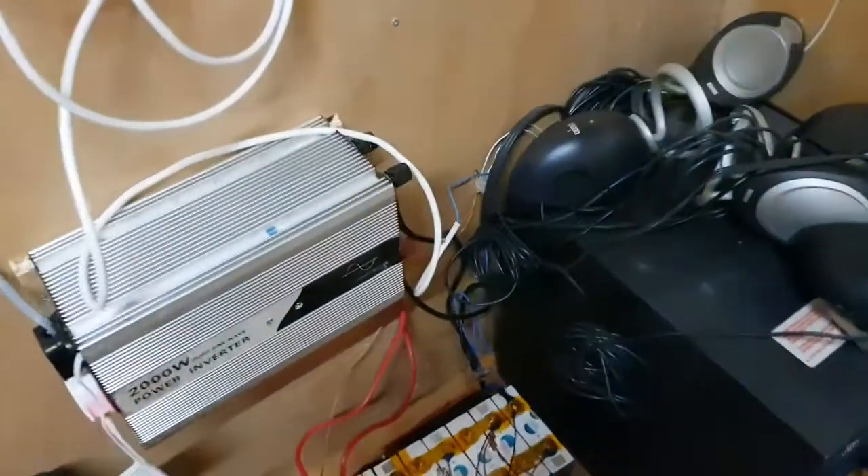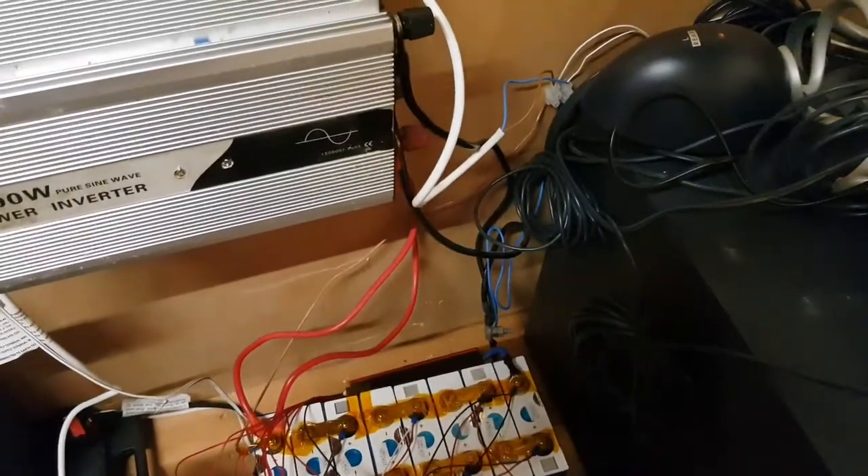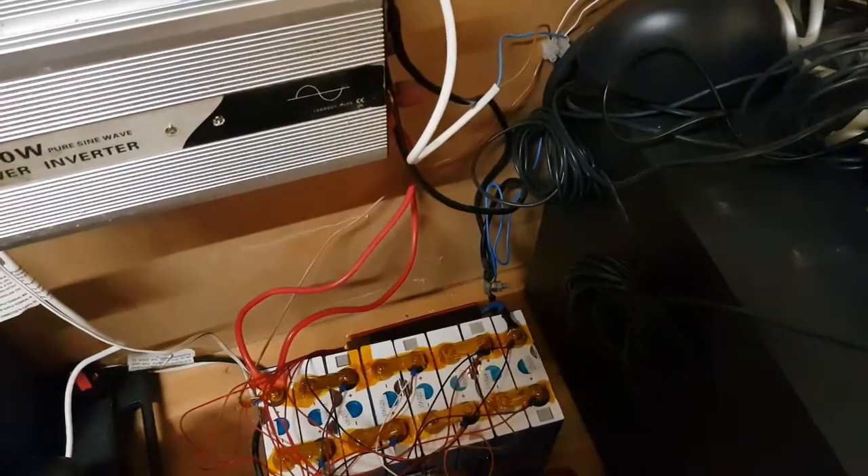All through this cable that runs all the way along the top and down to the batteries. For protection, I've got a polyfuse sitting here. That's a 2 amp polyfuse — if more than 2 amps is drawn from these batteries, it will trip. So what I've got to do is clip a buck regulator to that line and then that should power the Pi.